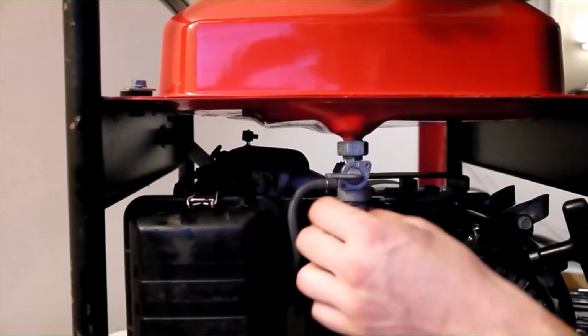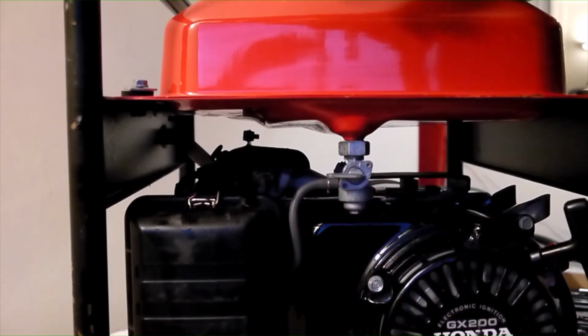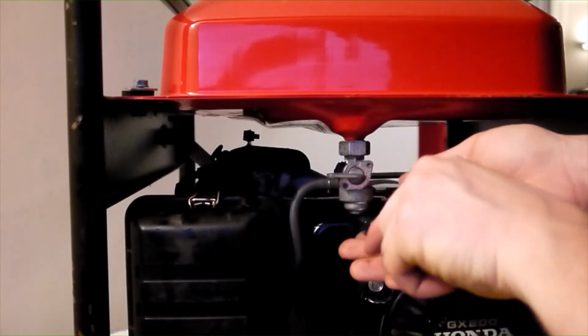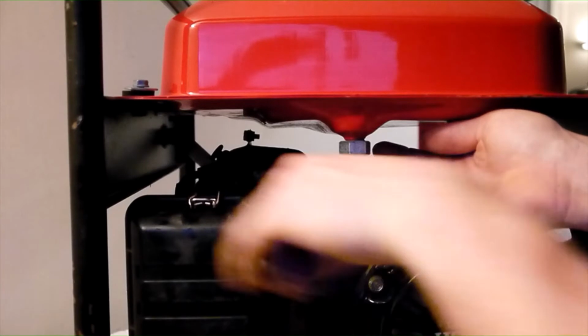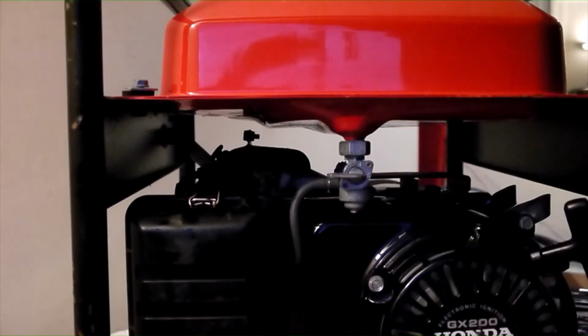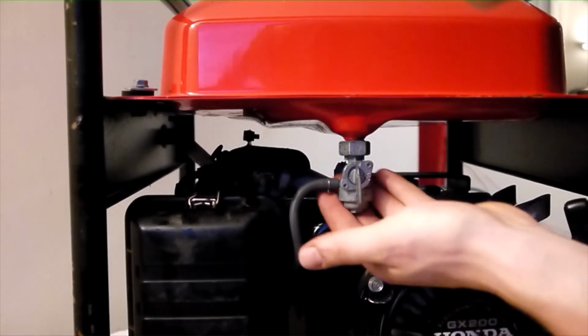Screw the strainer bowl back into the whole assembly by hand, then remove it once more just to check that the O-ring has been lined up. Once you are happy the O-ring is aligned, it can be screwed back in using the socket or spanner. Again, do not over-tighten, you risk damaging the O-ring. Once completed, turn on the fuel supply and inspect the whole assembly for fuel leaks.